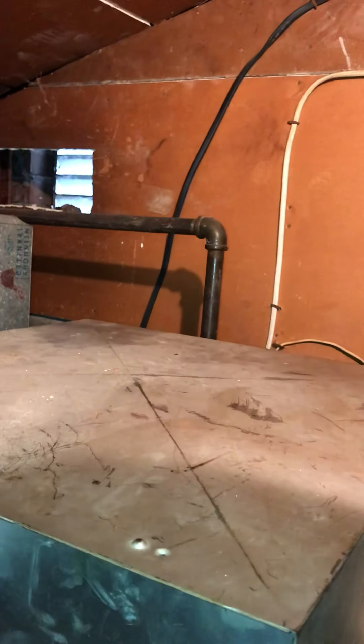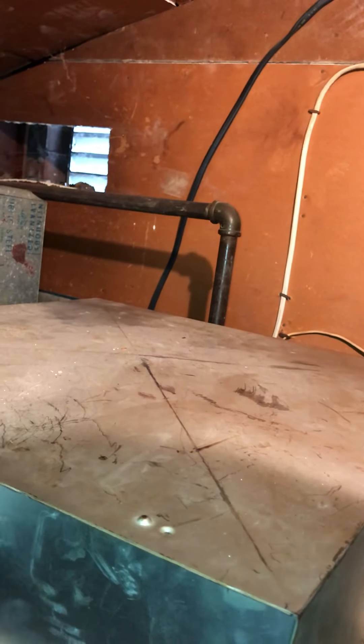The current filter looks like it's changed out through a little door on the bottom of the furnace. I didn't get a look at the other side, but there is an isolating valve on the gas and I did see a drip leg. We do have electrics up here with a light for visibility. The power coming in is actually from an outlet — it's just raw cable, not in conduit, so that probably needs to be tidied up.